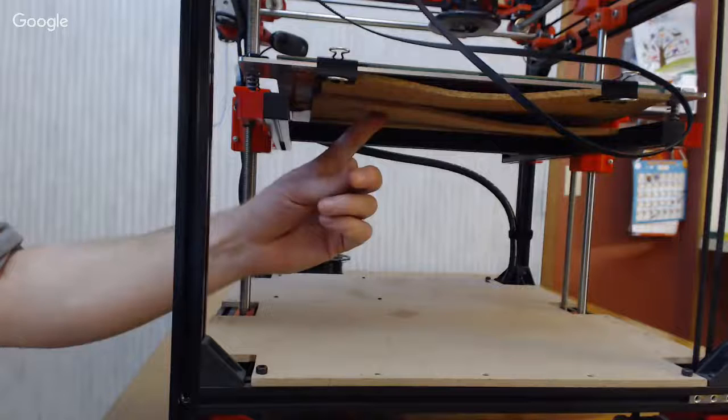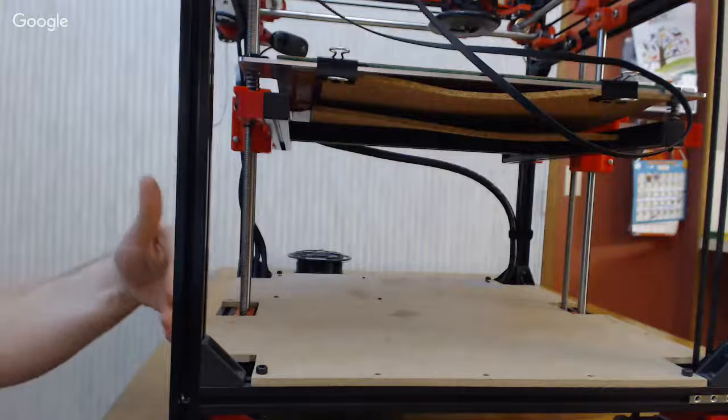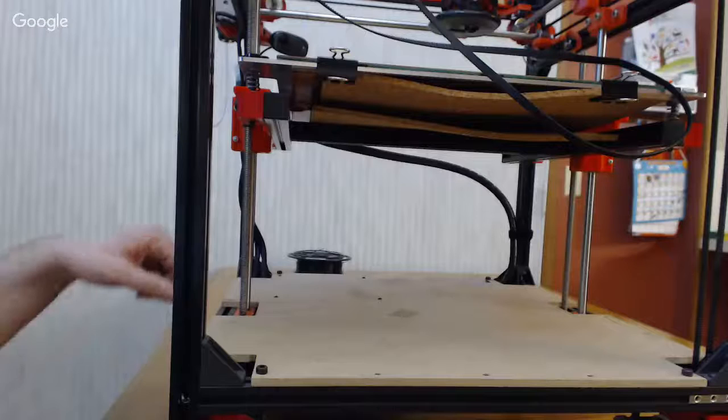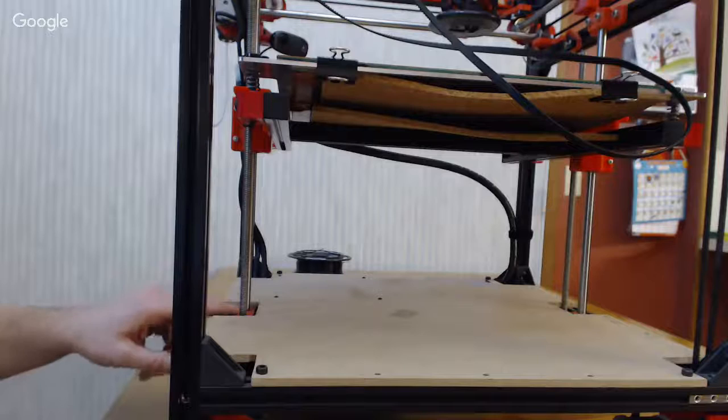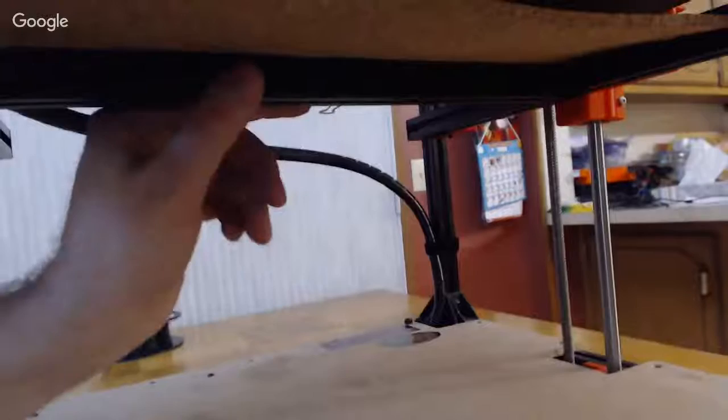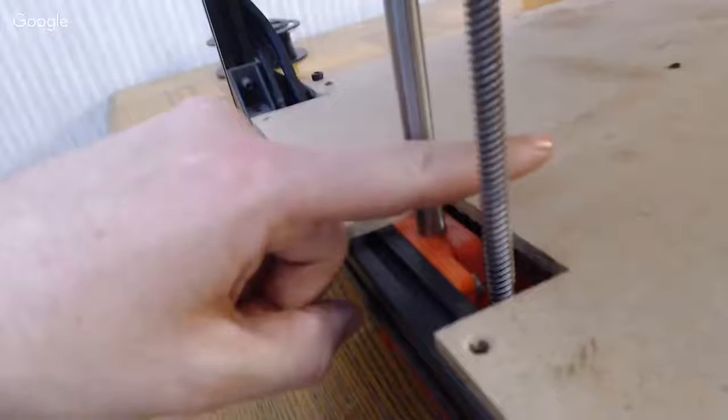But right now, this design assumes everything is perfect across X for things tied to the bed. And I'll kind of explain. We've got a rod at the bottom, which is bolted to a printed piece to the frame. So the frame's holding it rigid. It's got this printed piece to this rod to, maybe it'd be easier if I pop this thing out, which goes to this, which ties to this, and is fixed in a distance, mirrored between these two sides by this piece. So if your printed piece down here is a little fat, which moves this rod center in towards the center, mm-hmm.